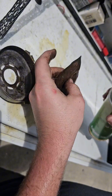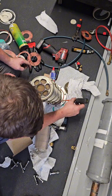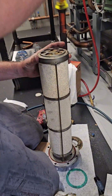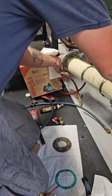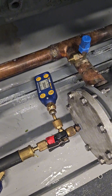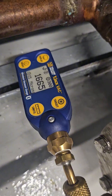Pretty bad. I had to use a whole can of degreaser and a nylon brush to get this screen cleared — it really needs to be replaced. Then I replaced the gasket on the cover and torqued everything back down, sliding it into the canister with the new filter cores installed and bolting everything back together at 30 foot-pounds.